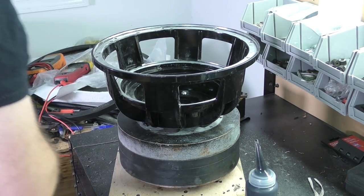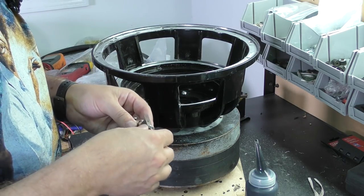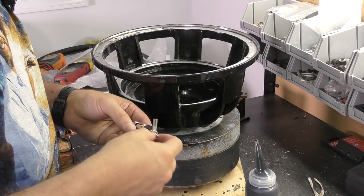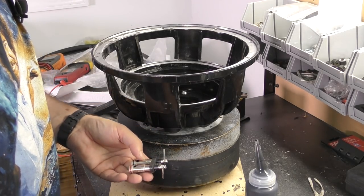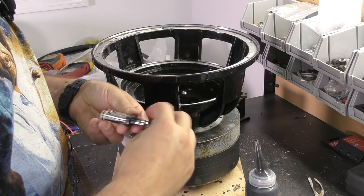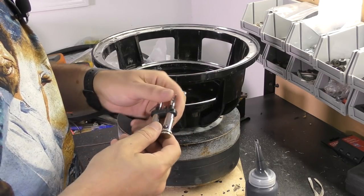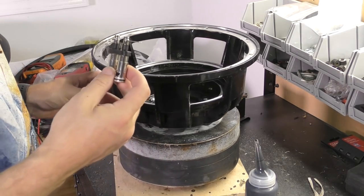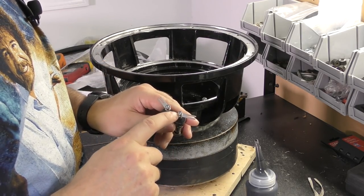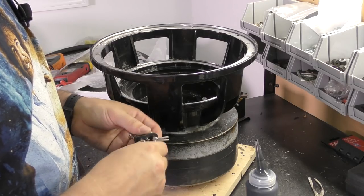And we're gonna get the new terminals on here. Now the terminals that were on here were all jacked up and broken, and they did some janky work to try to get them to stay back in place. I'm not having it. So I've got new terminals. These particular terminals you can get from fixmyspeaker.com. They are PSI branded on here, but they will go right on this basket just fine. Normally I do individual ones, but these I wanted to do on here because that's how this is set up, and it'll be a little bit easier for me to deal with having these screw-in types here. Just the nature of how this basket is and how it's designed originally.